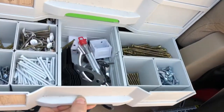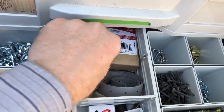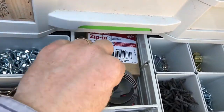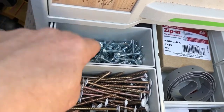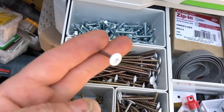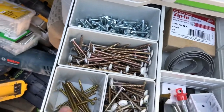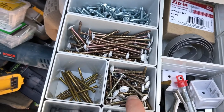There's that drawer. Bottom drawer — in here is a lot more of my most commonly used fasteners. I've got zip screws for heat and air work, electrical tape, and strapping. This plastic strapping is very handy — you need to tie pipes up out of the way whenever people haven't tied their stuff down properly. Sheet metal screws. These are a gem in remodeling: they're pre-painted white GRK cabinet screws. They will pull soffit together in places where a screw head would pull right through the material. They're great. I carry two lengths of them in my quick box here.